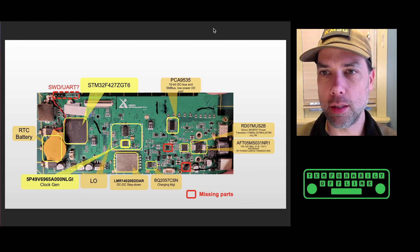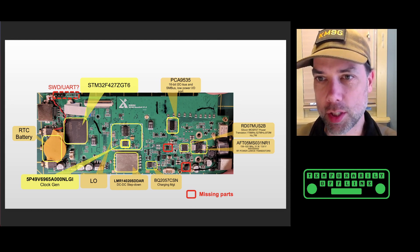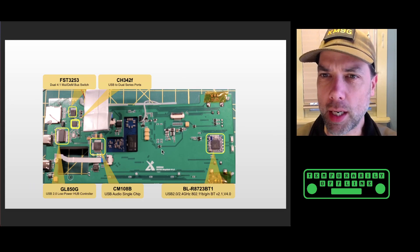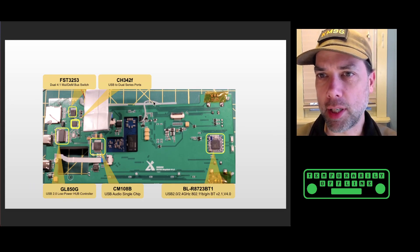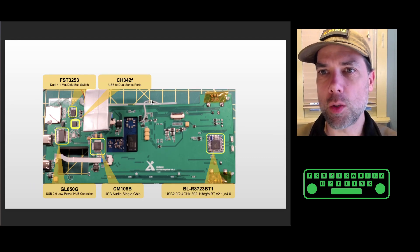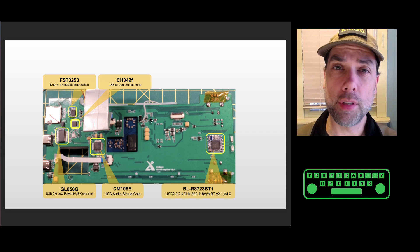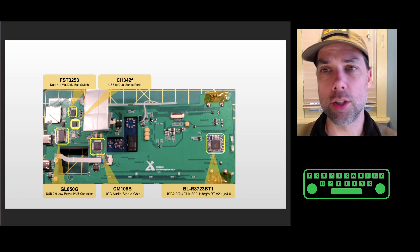This slide shows missing parts — we haven't identified what these parts are yet. Going back up one more time: this wire here is that bodge wire that goes to the back of the LED, and that's for the color indicator. You'll get your battery charging indication off that LED, your power-on indication, and it will also turn red when transmitting.